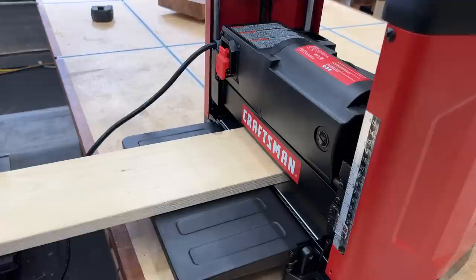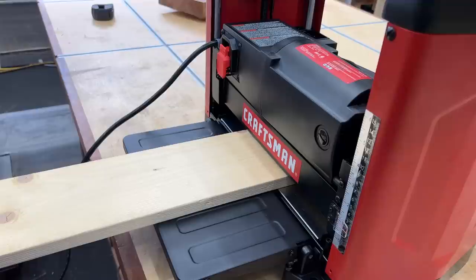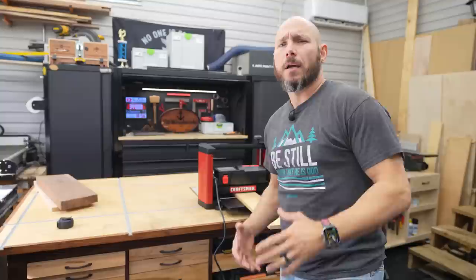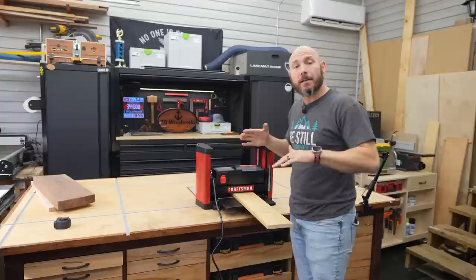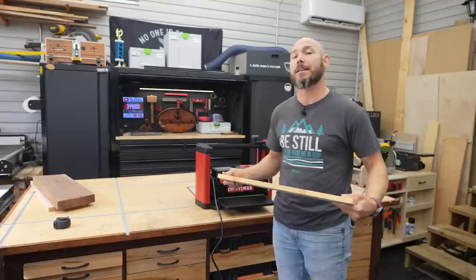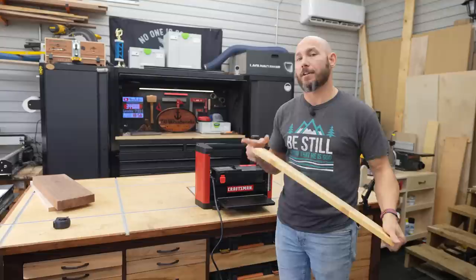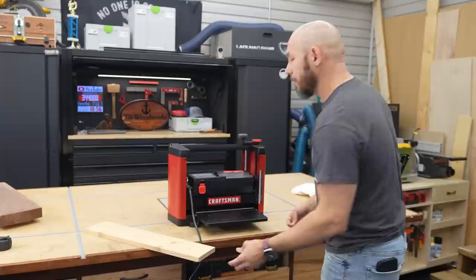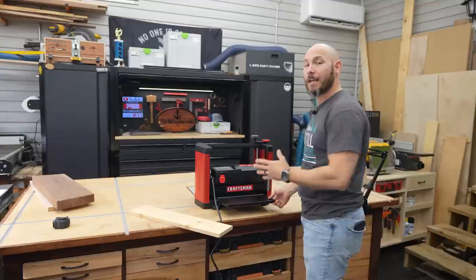When setting the height for the first pass, I just push the board in and lower it until it just catches the roller — you'll feel it as it starts brushing. Just enough so it pulls the wood all the way through without you having to push. You shouldn't have to push the board through; the machine should pull it on its own. A lot of benchtop planers are notorious for snipe — that's when the blade digs in on each end, the in-feed and the out-feed. To help prevent it, you can send a scrap piece of the same thickness in first, and never plane anything less than 12 inches, as shorter pieces can jam and cause major problems. You can also adjust the machine to eliminate snipe, and this one has those adjustments.